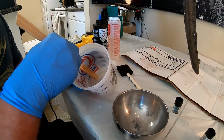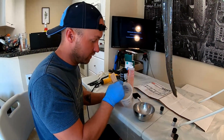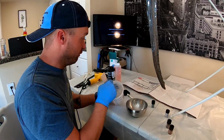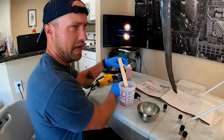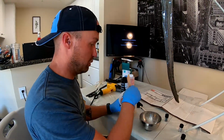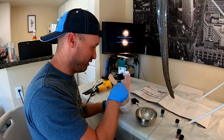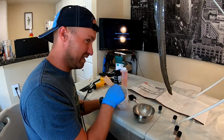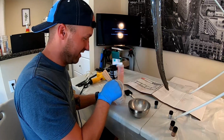I don't know if that's maybe if you're mixing the whole bottle, but I've never had any problems just using a single container and just mixing it for about 5 minutes. You do have to be careful if you are mixing all of it, because there's, I think it's called an exothermic reaction. So it gets really hot, and your epoxy will actually start smoking. Oh, snap. I don't know if it can actually catch on fire. I haven't let it get to that point, but it's definitely started smoking on me before. Like if you're not stirring it and you're just letting it sit there.